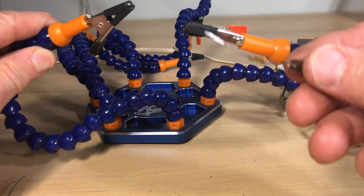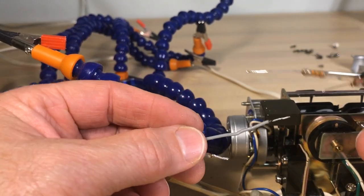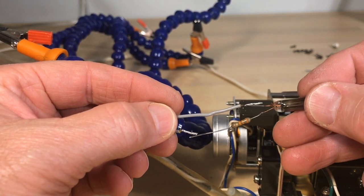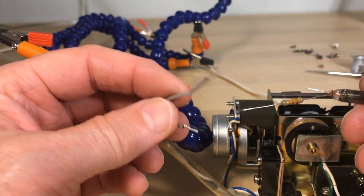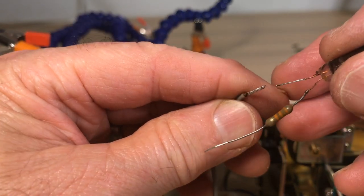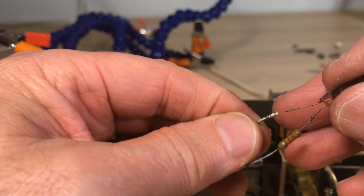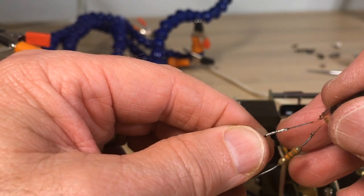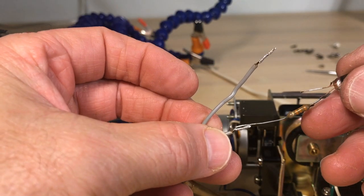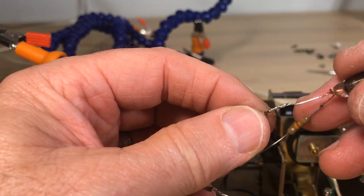I've already warmed up those connections and pulled this out — I had to warm that up with my soldering iron and it just pulled out. They had wrapped the wire around the leads and then soldered it. It would be funny if I could heat that up and slide it back in, but it actually wouldn't make a good connection. Usually you want to strip the wire and then tin the leads. Tinned means it's covered with solder. So we're just going to lay those side by side and solder them together, and it's actually going to work great.